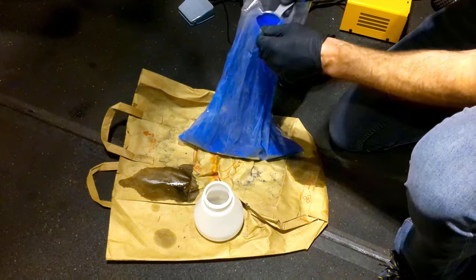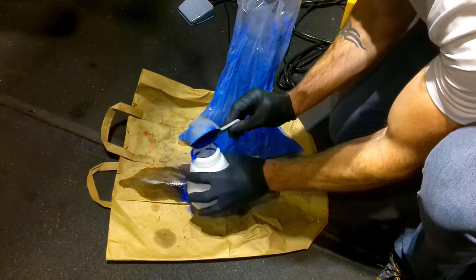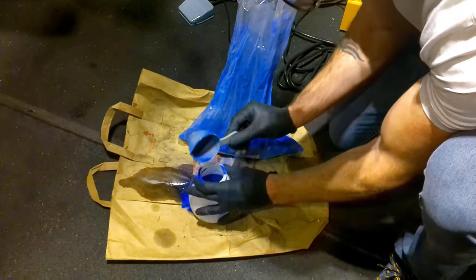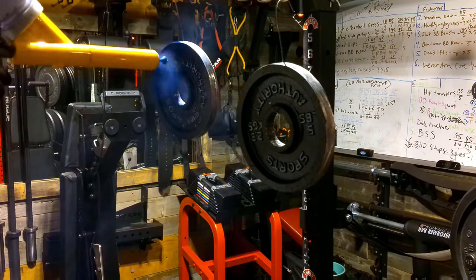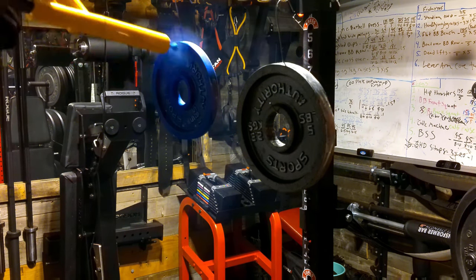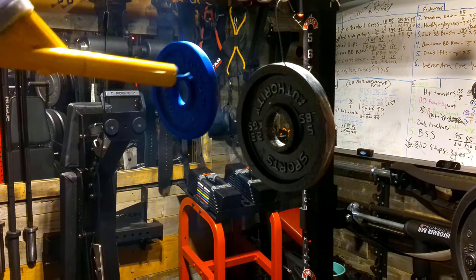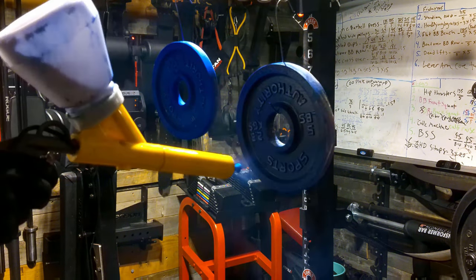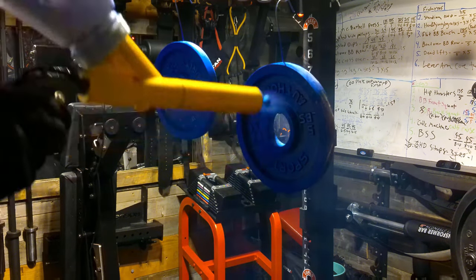And after those dry fully, the next step is we are going to be putting our powder inside of the powder coating system and we are going to spray. You want to use about 20 PSI on this thing and you're going to need to hook it obviously to the compressor. It doesn't have to be anything big or fancy since we're only putting out 20 PSI. Anything you have or can find cheap will do the trick.